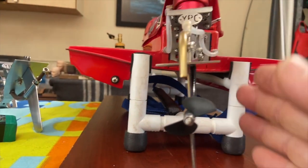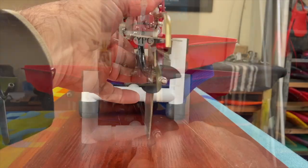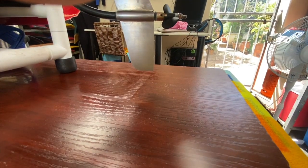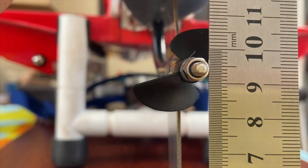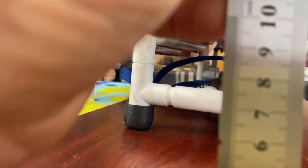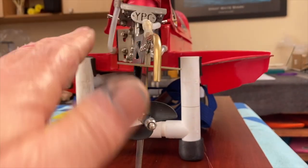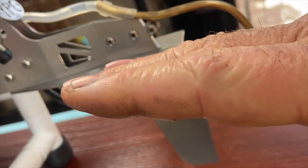It's that geometry that's almost like leaning a motorbike into a turn — this is leaning a boat into a turn. And the negative trim — which is 0 this way — you've got a 0, so you can see we've got one degree of negative trim when we turn. To the centre line of the prop it's about 94 millimetres. If I turn it to the left and measure it again, you can see there we are at 90 millimetres. So we're literally lowering our thrust line by up to 4 millimetres in a full turn. When you're lowering your thrust line — moving your thrust line down — that's what pitches the sponson down.